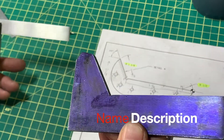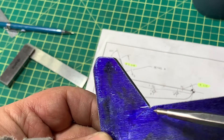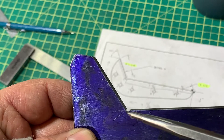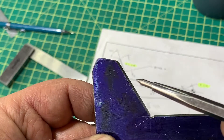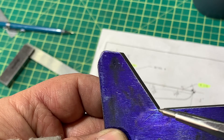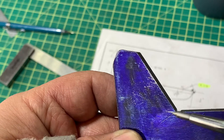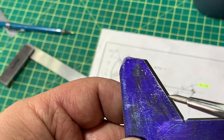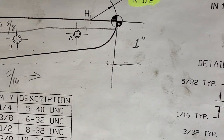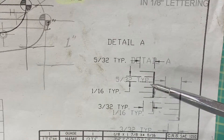The next step is to mark our scale. There are a couple of things to take into consideration first. You need to set up some marks to know where to start. The best way to do that is to stick out a straight edge and make a little mark, then put your edge on the other side like a square. Find the edge of the first mark you made and scribe your line — the square gives you that perfect angle and this will be where we start our lines: one, two, three, etc.